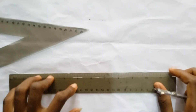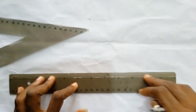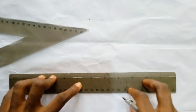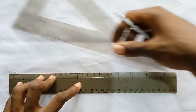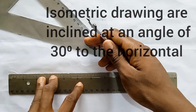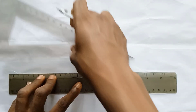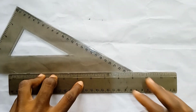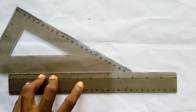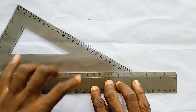For every isometric drawing, you must make sure that your baseline is very straight, because if the ruler is not straight it will affect your whole work. The instruments needed are a ruler, a 30-degree set square, and a pencil. Place the ruler straight, then place the set square on top. Isometric drawings are inclined at an angle of 30 degrees to the horizontal.